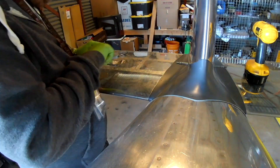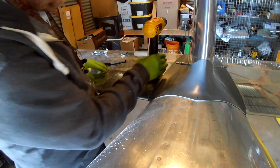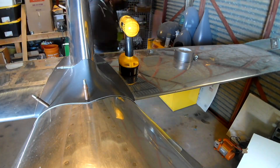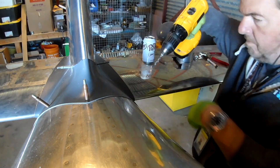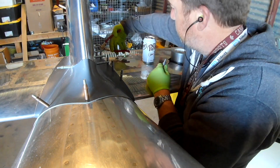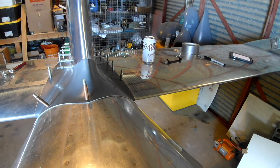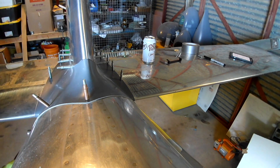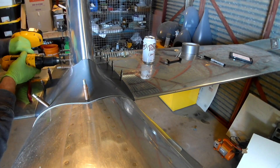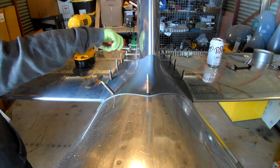Here you can see we're doing the blind drilling of the holes in the front. These are much bigger — the screws in the back are number sixes, and these will also wind up being number sixes. You directly drill to number 30 on these, and after you're done drilling out the holes in the back, you'll go back through and re-drill — I think number 27s for number six screws. Anyway, we'll pick that up in the next video. Thank you for joining me everyone, see you soon.